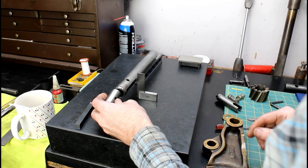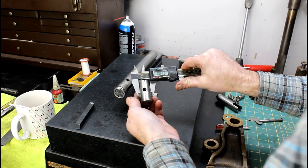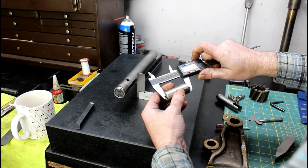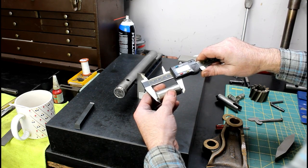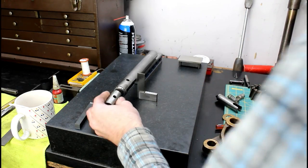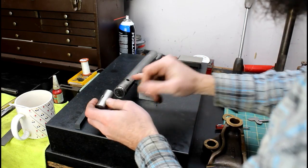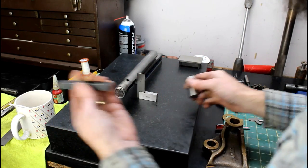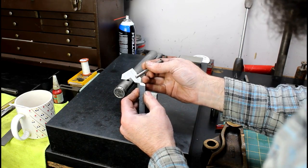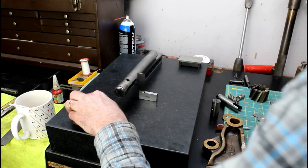And here's the broken end of the shaft. It measures 873.5 thou and is around 2 inches long. That's what we're going to cut it to anyway, 2 inches long. Instead of the sharp corner that they had right up here where it transitions from large to small, we're going to use a radius, about a 3/64 radius. It's just a piece of Lathrop Crusader XL.